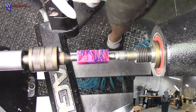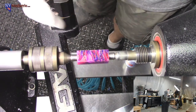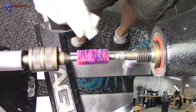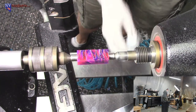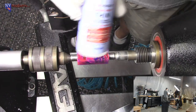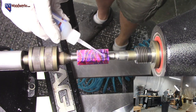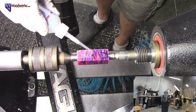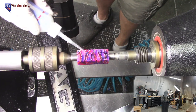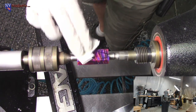If you're just joining the fun, like I explained on the first half, if there's any problem, I'm a little worried that this metal and the resin are not going to have a good bond, in which case it can just blow apart when I'm turning it. So I'm adding a little bit of super thin CA glue. It tends to seep in. It's the super fast thin from Starbond, and really pretty much most thin CA works. You can look up the viscosities. Any brand will do as long as it's got the same viscosity. It tends to soak into really small cracks, and that way we're stacking the deck in our favor so that it doesn't come apart. If there are any areas with a weak bond, hopefully we're gluing them together before we start and eliminating that problem.